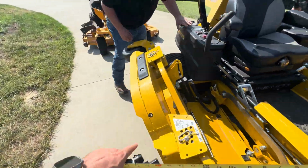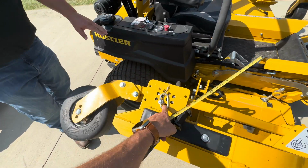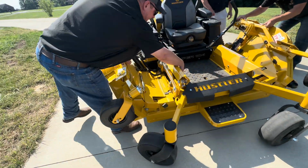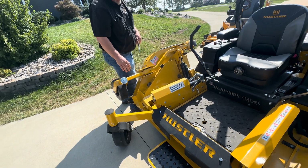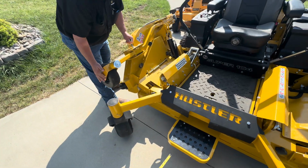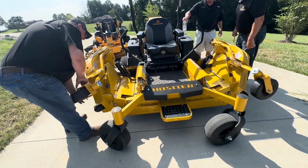So to change the blade, you lift it up with the hydraulics and then shift this arm and put your pin in where the number's set at. Right. And you've got 5 points that do that? Yes, you've got the main deck right here. We'll change it here in just a second. The deck changes better if you've got it up a little over a 45-degree angle, to take the weight off. Second from the back on the bottom.